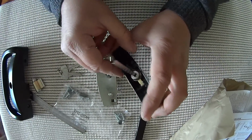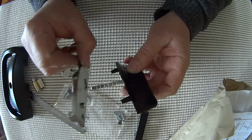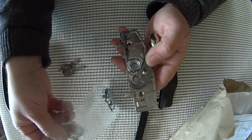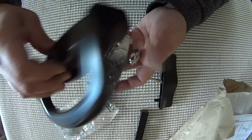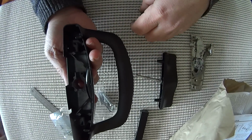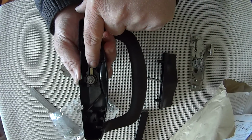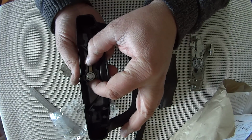Okay, so if we've come through the door and we've cut our tailpiece, we then need to screw our lock body to the door, which we do with those screws that I showed you. The longest screws in the pack, metal thread, straight here and here. Then once we've got this established on the door, we're skipping a step here, internal. Now those step downs that I just spoke about, once again, need to be used on this cylinder here. Flip that in. It's not a step down, it's a step up now. Black screw, step up, secure that in that position like that.